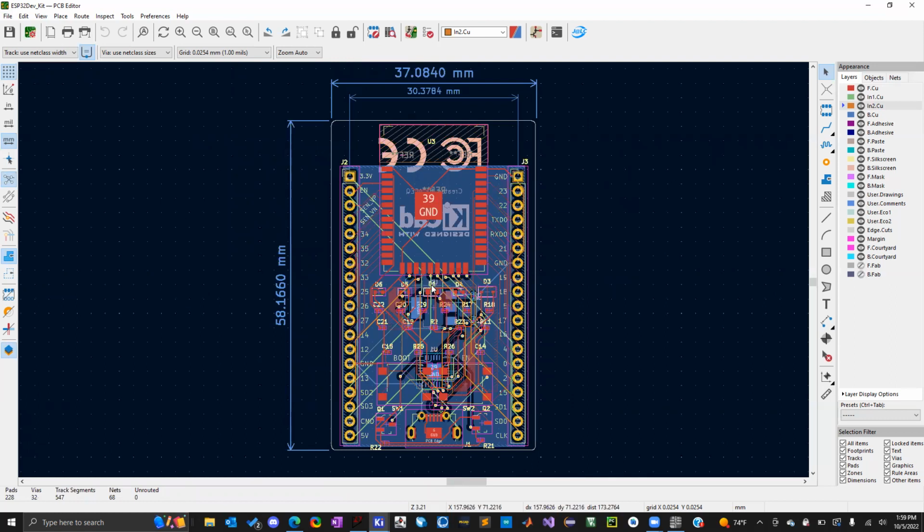This is what you guys have to look forward to in the following three sessions. And then I'm going to go over that auto routing tool, which can save you a lot of time. I wanted you guys to make the traces yourself, though, just to get used to how to make the connections manually, because you'll have to do that pretty often. And the auto router is not reliable at all. I'm going to be blunt. The auto router doesn't know what signals are important. That's up to you as the designer to keep that in mind.